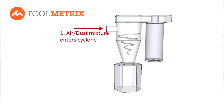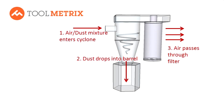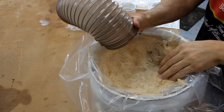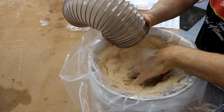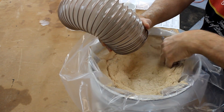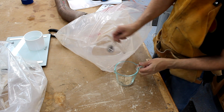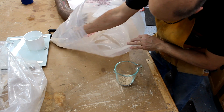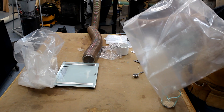Now let's talk about air-dust separation. One of the most important things a dust collection system needs to do is separate air from dust — putting dust and debris into the barrel and air out through the filter. When it sends dust into the filter, the system will clog, performance will drop, and you're going to spend a lot of time cleaning out the filter. To test this, we sent 5 gallons of the finest powdery MDF dust through the systems — notorious for clogging up filters. When we ran this test on Laguna's previous generation 1.5 horsepower dust collector, we saw about 6 tablespoons of dust end up in the filter — not bad, at about 99.84% clean separation. But the new machines sent an average of about 1 tablespoon of dust into the filter, which is an 83% improvement, meaning less maintenance and better performance.